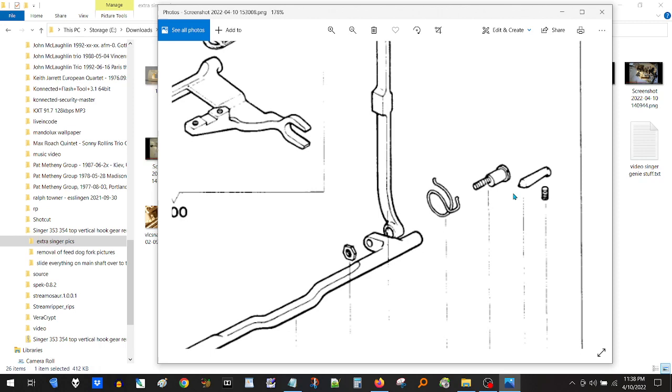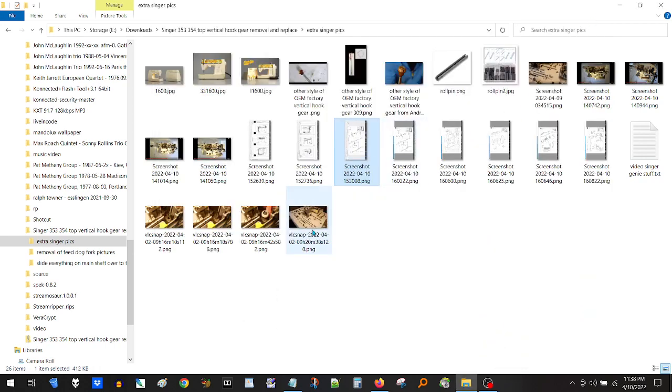This also has a lobed bolt. You loosen the nut, you spin this around to adjust, and then there's a slot here for a screwdriver to hold this in place while you tighten the nut. So once you get this in the right area, you've spun it the right way to get your adjustment, then you tighten this nut on, I believe. There are videos on how to do this. Andy Tube, he's got a bunch of videos. I'll link it. And that's about it.